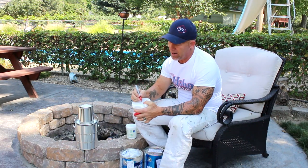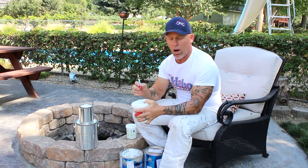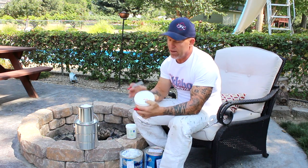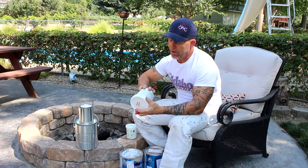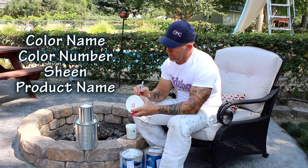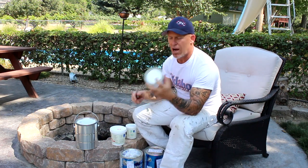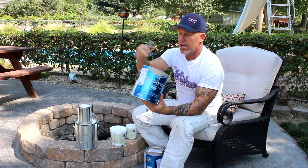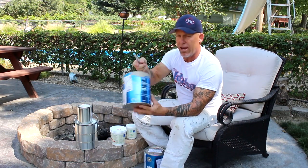What I usually do is write on the top where this product was used — for example, if it was on the interior bedroom or kid's room, I write that right on top. On the sides, I write the color name, the color number, and the sheen. Same thing — label the top and the sides. If any of that information is not exposed on your can, write it where it's not covered with paint, so when you take it back to the paint store, they can mix up the proper paint for you.